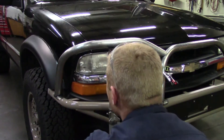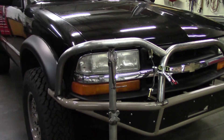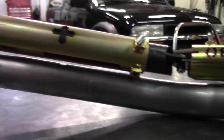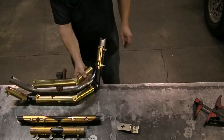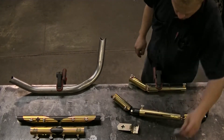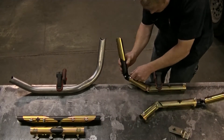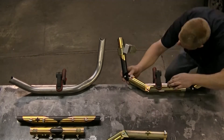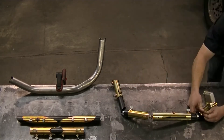Now that's looking pretty dang sexy, so I'm gonna check it out from a few different angles. The left side is just a little long, so all I need to do is cut a quarter inch off that cope and we'll be good. Here's the final tube compared to the jig — you can see how nice it fits. There's a little gap in the middle because I missed the rotation at the end just slightly, but it really doesn't matter because everything else is perfect. Now I can use this tube to mirror the jig to the opposite side. I'm gonna use the other large hinge so I keep the jam bolts in the right orientation. First I want to mark the copes and tubes so I don't have to measure them again, then I can flip the jig around and transfer the small hinges to the new side. Next I adjust my bend rotation to match the other side, then swap the coped tubes so the jam bolts are facing the right direction.